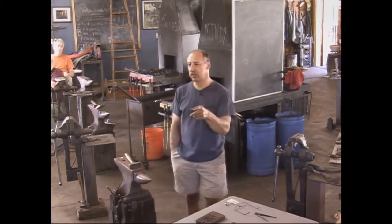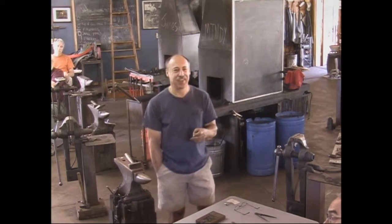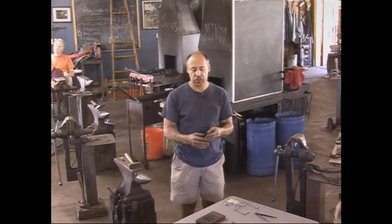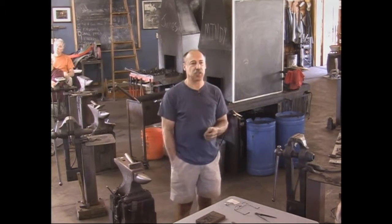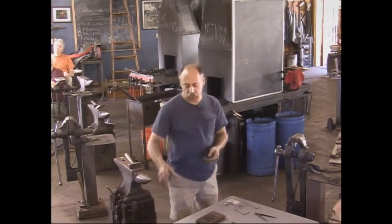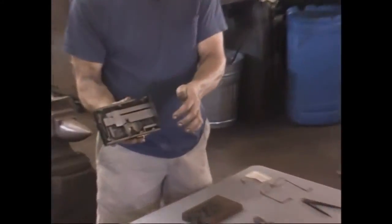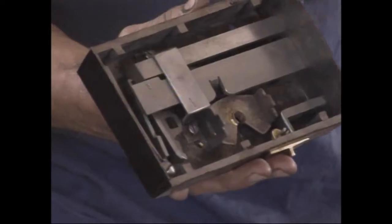Where's another question about brazing. Yeah. So the way you braze is in the fire, and they just use yellow brass usually as the brazing material, and borax as flux. And so brazing, in fact, the wards in the lock, that circular ward is brazed into the ward plate, and that's the way the old ones are done.